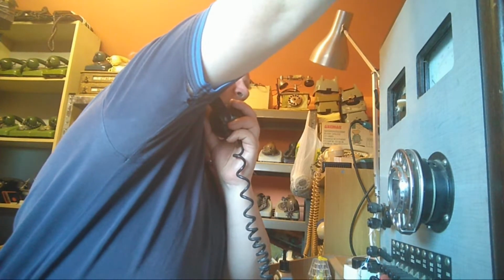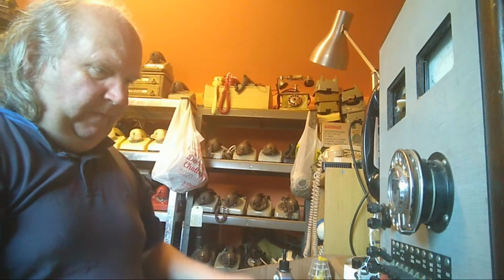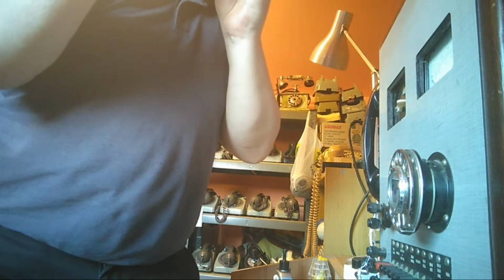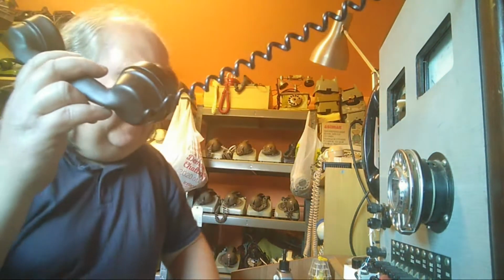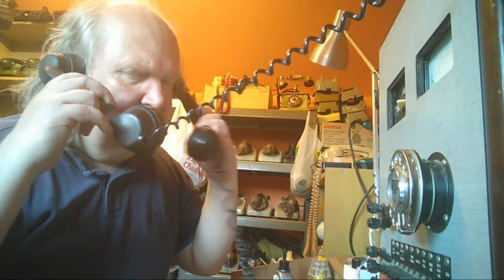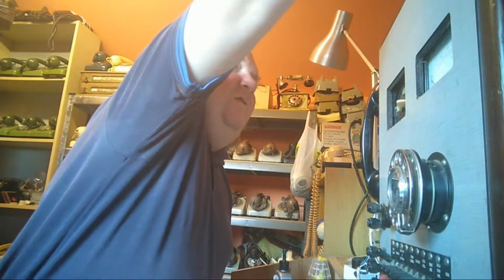Now, you can also do this the other way around, because this is online. This is on 22, I think it is. So I can pick the phone up on the other extension here and dial 22. No, it's not 22. Oh, it is. And that rings on a bell set in here, you see. So I now pick this up, test exchange again, pick this up, and again I can hear myself like that. So that's testing the exchange side of it.